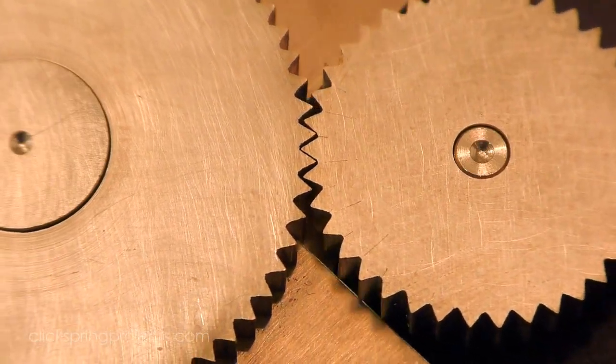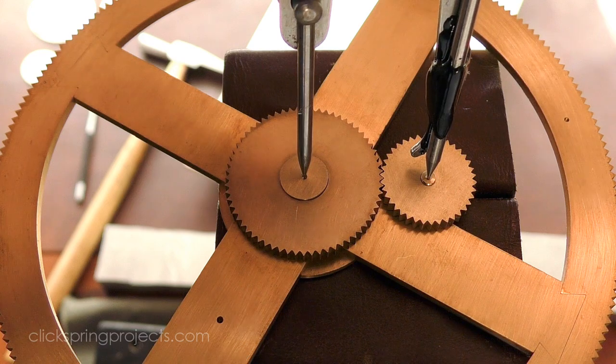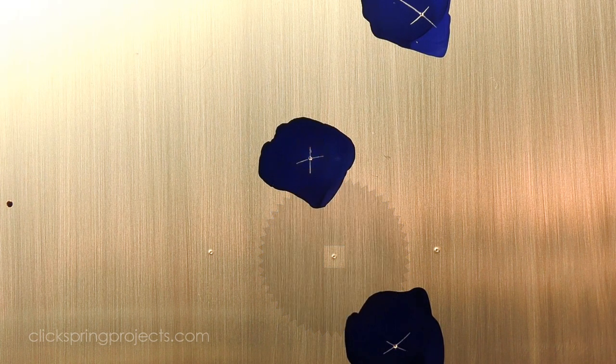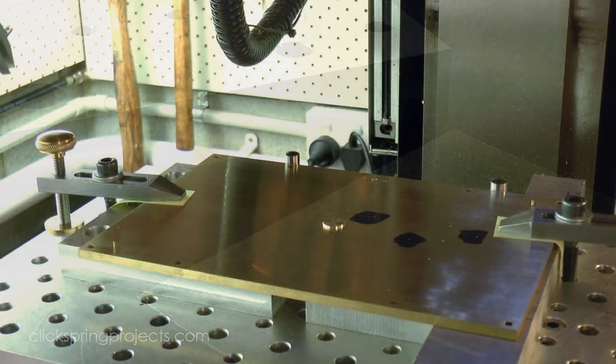And there's a further advantage to triangular teeth if the wheel engagement is found to be a little tight once the pivot positions have already been drilled. In that instance, the entire outside profile of one or even both of the wheels can be very slightly filed back, much like when the teeth were originally formed, so that the final stage of depthing essentially becomes an extension of the tooth forming process. And I'll show you some more detail on this later in the video.